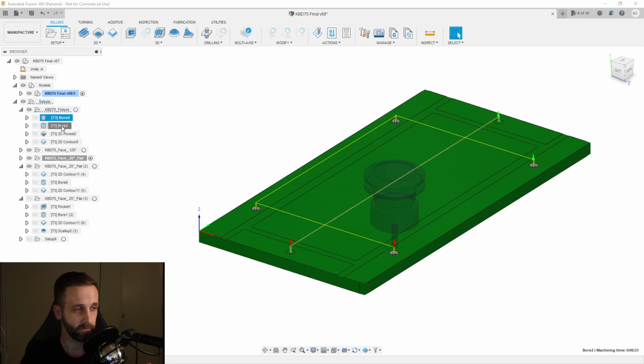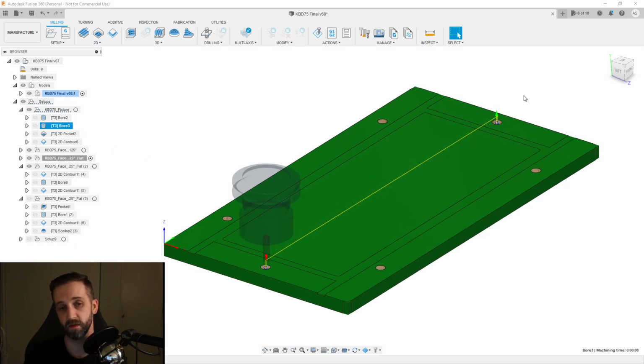And then I came in and bored these holes, but these ones I wanted to be tight, right? So I did the same thing where I left some stock to leave, and then I milled those down until I had a nice kind of press fit with the dowels, because once those dowels are in there, I don't want them coming out at any point. So that's why I kept these four separate from these two, because I wanted them to be slightly different sizes.